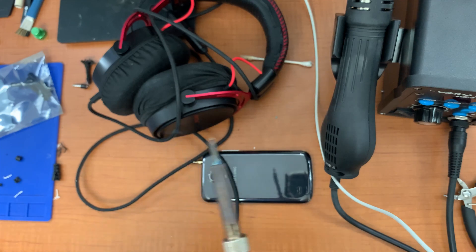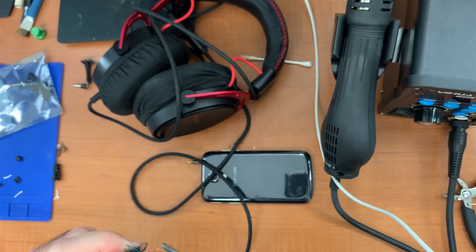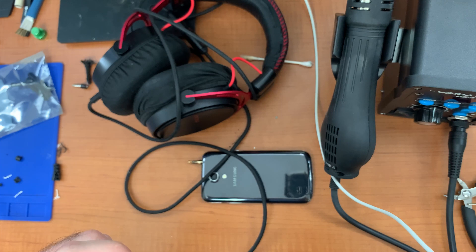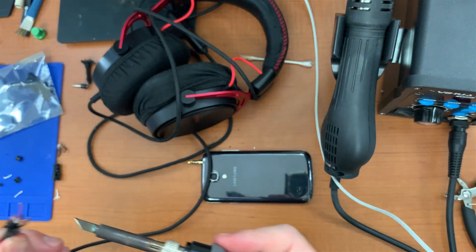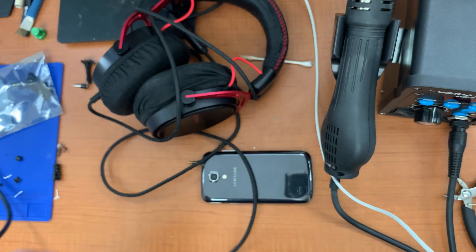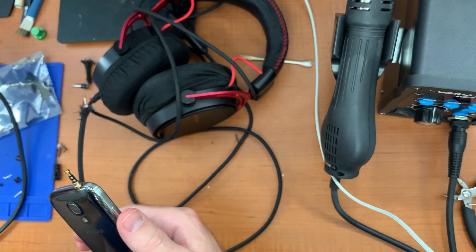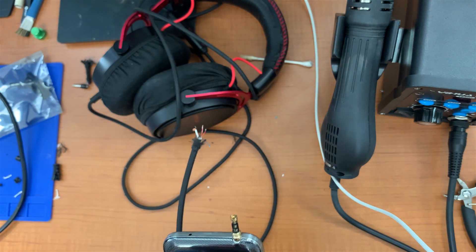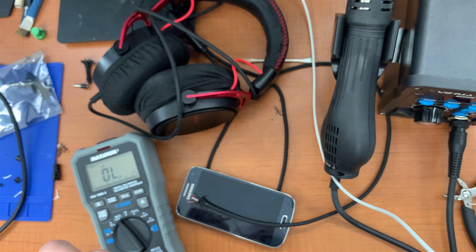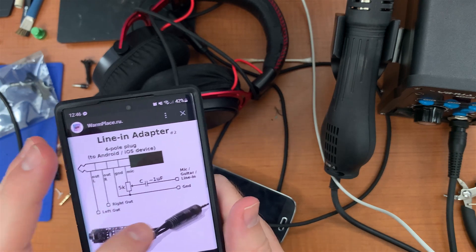Okay, let's tin this red one now — very nice. I'm going to guess that this one right here is probably the left, tinning quite nicely. Most of the work I've been doing with this kind of stuff hasn't been headsets, but mostly stereo systems when I've been working on sound equipment. This is a bit of a new experience for me. So: ground, either one of these should work whether it's left or right, and the one at the bottom is the microphone. Which one's ground again? Oh, I feel like an idiot — it's near the bottom. I just find it really confusing that the microphone is this big honking huge thing I would usually associate with being the ground pin. Left for the tip, right for that one. The third one in is still ground, and the mic is still the very bottom.